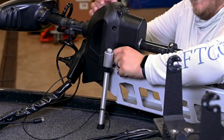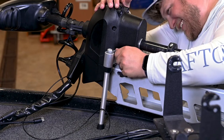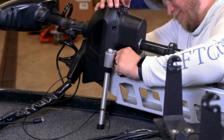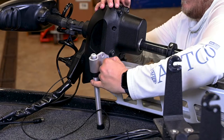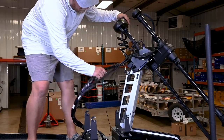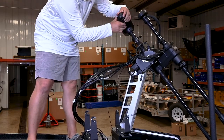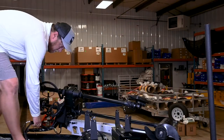Determine if you must uninstall or reinstall your trolling motor stabilizer. You will need to uninstall and reinstall the stabilizer if you are installing your MegaLive on the starboard side of your trolling motor, or you are installing the dual mount accessory for MegaLive and Mega360 installation. With the trolling motor deployed, the transducer should not have anything obstructing the view of the beam. If possible, move anything to the sides and below the transducer that might obstruct the sightline of the beams.